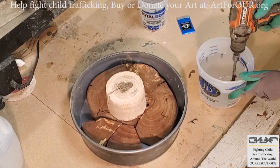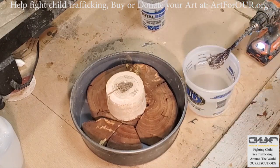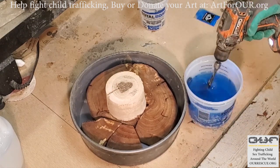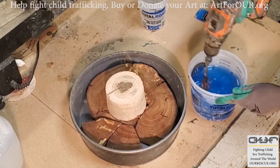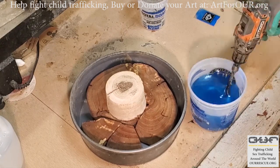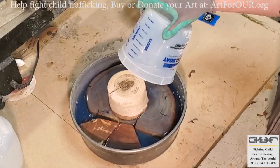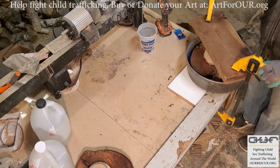The first project was really cool, but the challenge was to get rid of that cell phone imprint without ruining the wood. And this specific one I decided to do with epoxy had some pretty deep cracks in it. My thought here was that there were enough holes going down into that big cell phone shaped divot that if I did it upside down, filled it full of epoxy, the air should escape and I should have a nice big blank to work with to turn into a bowl or a platter.